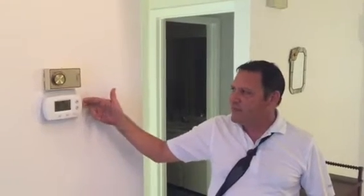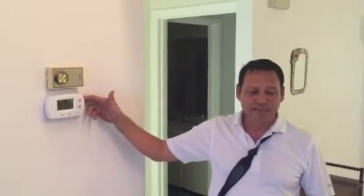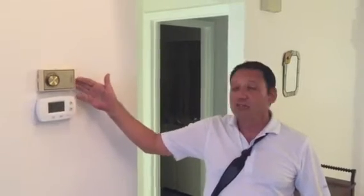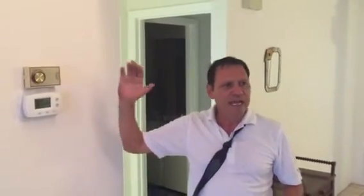If the air conditioning system is designed to keep your house at around 47% relative humidity, I'd rather just go with that. Unless you're going to be gone for a really long period of time, then I would set it to probably 50 or 55% relative humidity — it'll keep your house dry without allowing mildew.